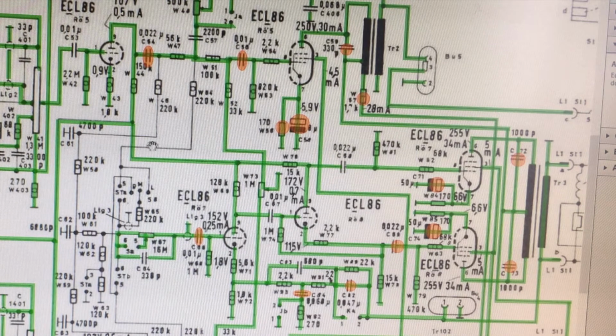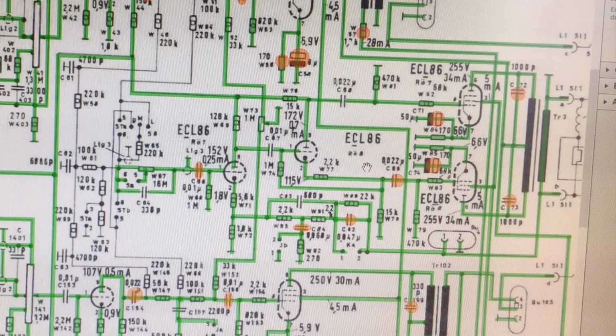this signal is taken off there and it goes to join the other signal from the other side, and this forms your central amplification stage, your push-pull amplification stage. They mix together and you're getting a mono signal. And then you've also got these two triodes of those two power tubes creating a phase inversion so that you can drive the push-pull stage, and then you've got your two push-pull power stages there with the respective transformer.